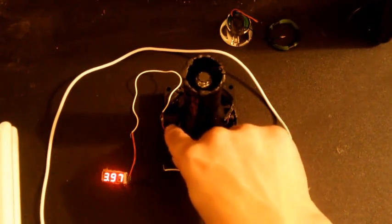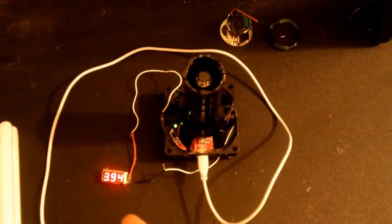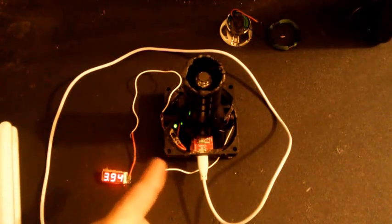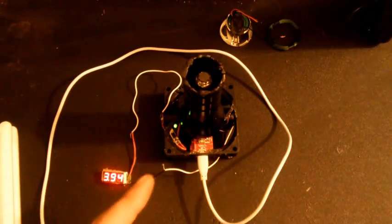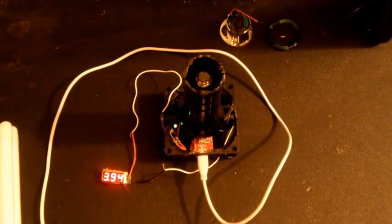I've got this little digital readout right here — I'm going to cut it on real quick just to show you. You can see from the drop it's hardly pulling anything. Also, the cell in here is a very cheap 18650 protected cell, and it's important that it's a protected cell because my circuits will oscillate down below two and a half volts, and your cells don't want to drop lower than that to maintain their health. A protection circuit is a good way to ensure it cuts off and won't continue to oscillate down below two and a half volts and ruin your battery.